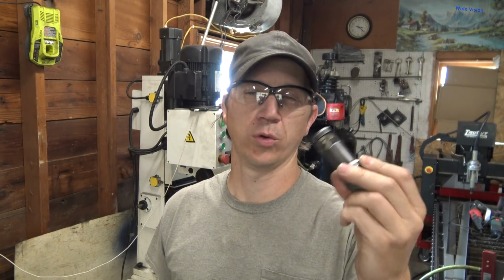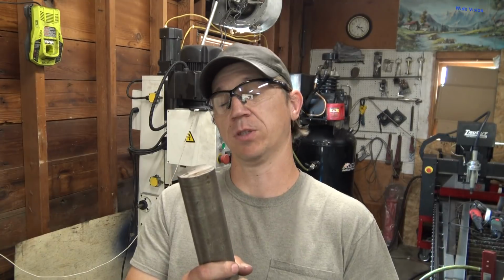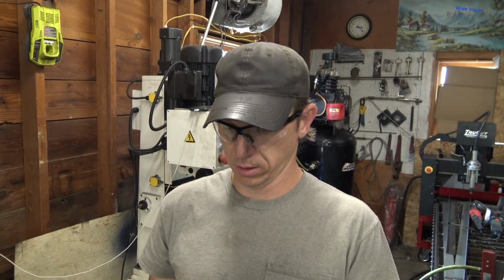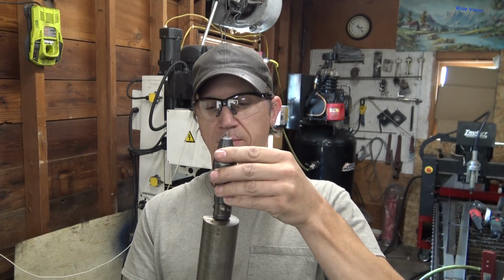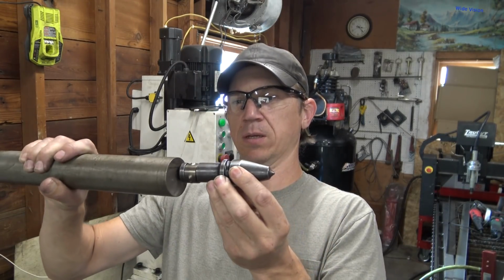The outside of the holder for these things is measuring 1¾. I have a little bit of 2-inch left. So my original thought was to go ahead and turn this down to 1¾, but I was thinking about it, and that's really not that big of a difference. I don't think it's going to matter. But then I decided the easiest thing to do would be to simply drill it off to the side a little bit, right? I think the reason it's 1¾ inches is just because of the diameter here.